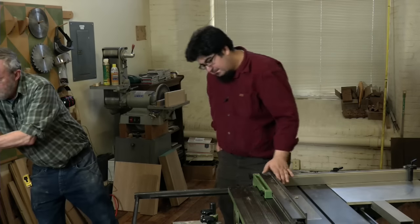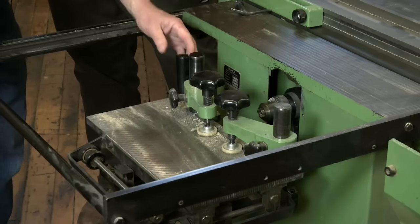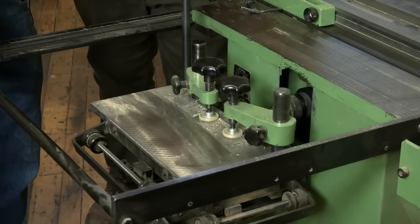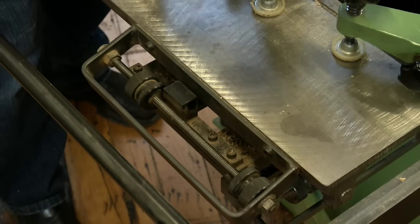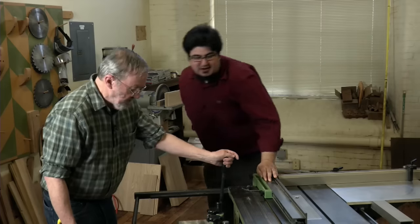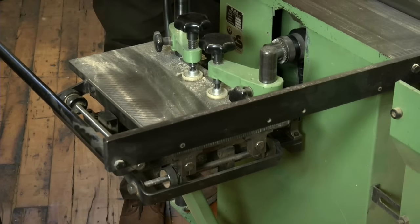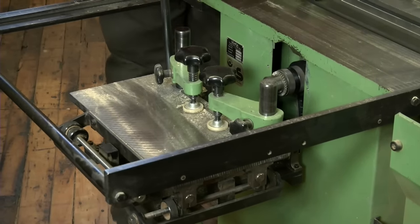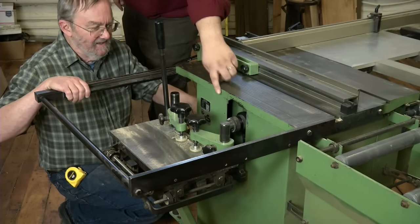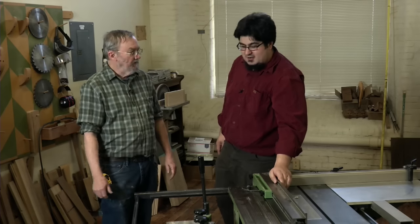Now I have easy access to the mortiser. To get the mortiser to work, all I do is pull up the control arm and there's my XY axis — controls right there. I've got a positive stop right and left, and I've got an in and out stop over here which controls my depth. The height of where the mortising blade is going to cut is controlled on the saw's height adjustment. This Jacob's chuck is just attached to the arbor, direct in line with the arbor.